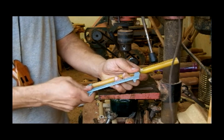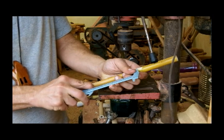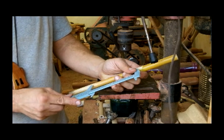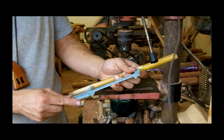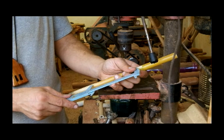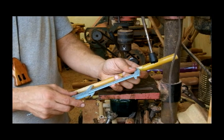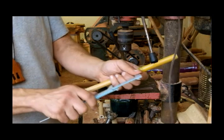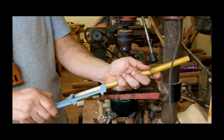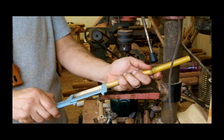This next one — using a little cheap caliper — we're looking at almost exactly four and three-quarters, just a smidgen, like a thirty-second over four and three-quarters of an inch, which is roughly 121 millimeters to the last hole. And then from there to the end — you're going to have to tune these things after you get them drilled — but a rough estimate, you're looking at about another three inches, which is roughly 76 millimeters.